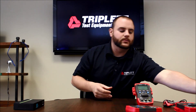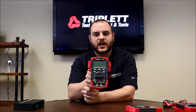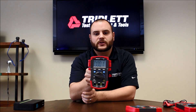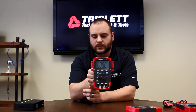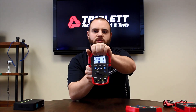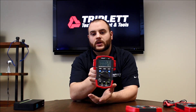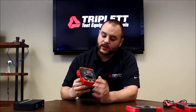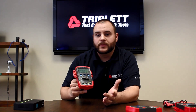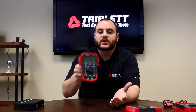As you move up to the top-of-the-line compact meters, we have the 1401. The 1401 is a true RMS 6000 count digital multimeter. It's also auto-ranging, so the meter actually detects what range you need to be in. It has the same automatic backlit display, making it easy to use in dark situations. It does 10 amps AC/DC, up to 600 volts AC/DC voltage, and it has a relative function. It's really nice to get a compact meter that's true RMS with a 6000 count display — something not often seen in a meter at this size.